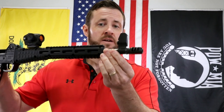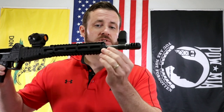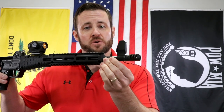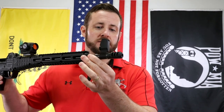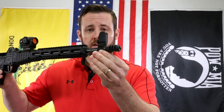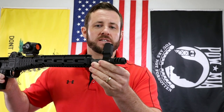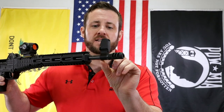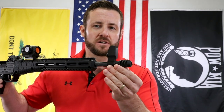For aesthetic reasons and simplicity moving forward, we're going to make all our brakes with a crush washer. If we have to, we'll come up with barrel jaws that work for the specific firearm, like we did here for the sub. With the sub 2000, we've got the barrel jaws that'll help you get your muzzle brake timed using a vise. The crush washer is reusable to a certain degree — you can back it off if you miss your timing and use it again.